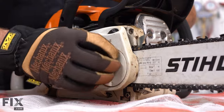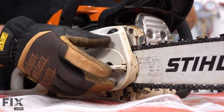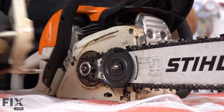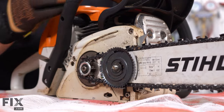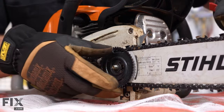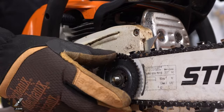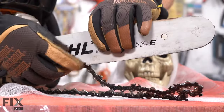Now on your model it may be a bit different as to how your chain and bar are held on. There may be a bolt or two that you need to remove to get the side cover off, and of course always check your manufacturer's instructions as to which bolt you need to loosen and the best way to slacken off the chain tension. On this one it's just a matter of turning this wheel to pull the bar back towards the saw, and that gives us lots of slack in the chain to just slip it off the bar.